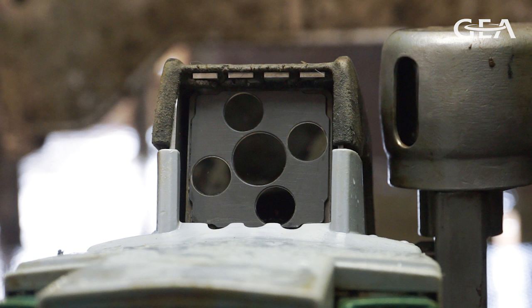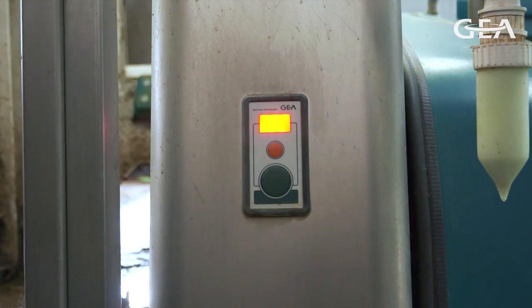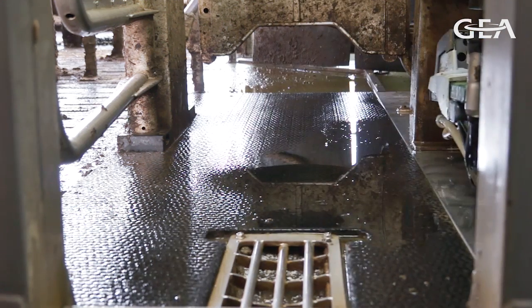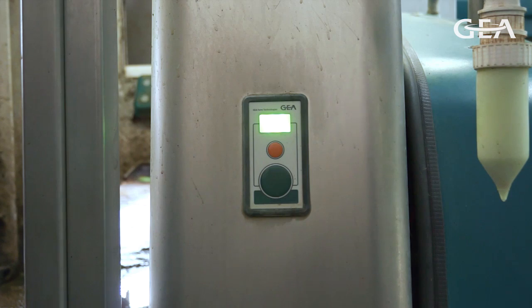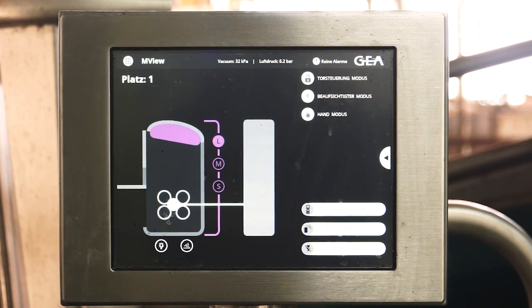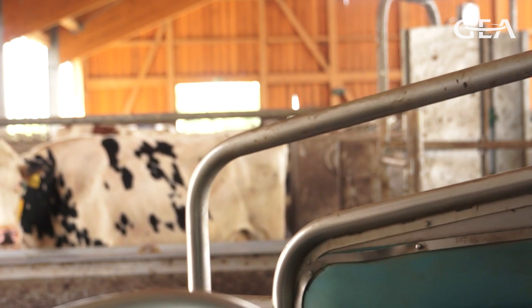Make sure there are no streaks on the optical sensor. If necessary, repeat this step until the optical sensor is completely clean. Once finished, press the orange button for more than three seconds to return the milk rack into CIP position. The display turns solid green. Under Aim View, press Enable Box and Open Entry. Now the robot is ready for milking.